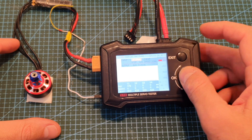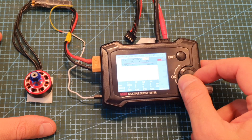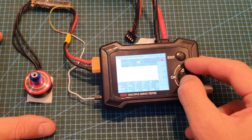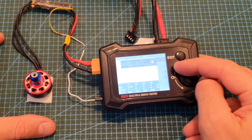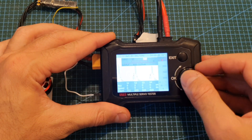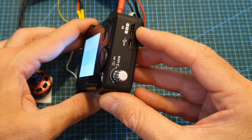You can also set it to switch between these values in stages, toggling between 920 and 1131. You can set the steps timing between 1 and 10, and adjust the speed between 1 and 10 milliseconds. In addition, you can set the input to signal 5 and then choose between PWM, PPM, and SBUS signals — signal 5 being the port on the right side of the servo tester.